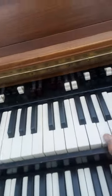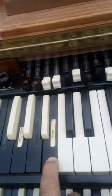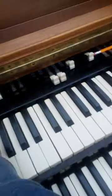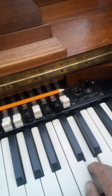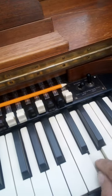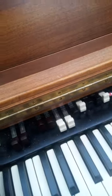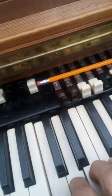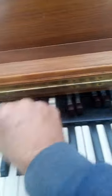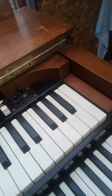It works. It's missing at least two frequencies — I don't remember exactly what it was. That D is missing on top and bottom. I've dealt with this before: you pull the next drawbar out and it's missing an octave off, which you'd think is in the generator. My recollection is I checked every generator note and it was working, but maybe I'm wrong.